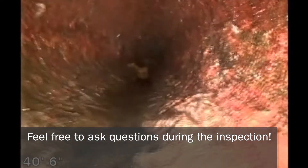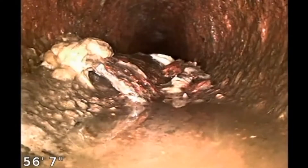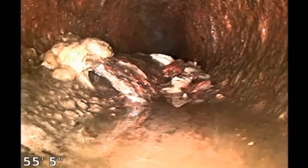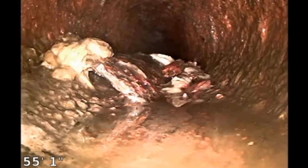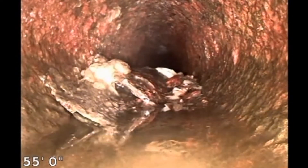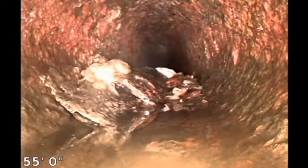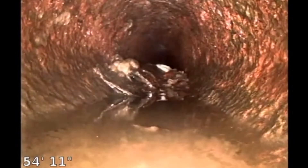We can clean that and remove those shoulders — it's just a flat piece of scale that's in the way. That grabs the paper and then the paper accumulates behind it, and then you've got a blockage. The pipe is round but it develops corrosion scale on the inside. Sometimes it breaks off, especially when you've been cleaning it — banging on the sides — and that scale can come off in layers or in little snowflakes.